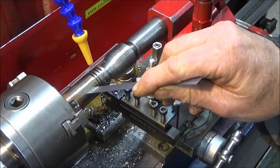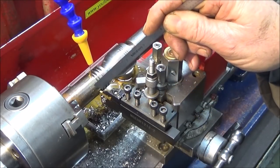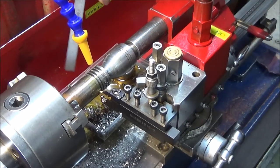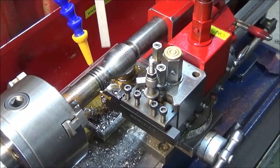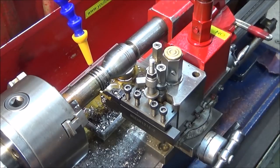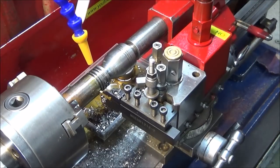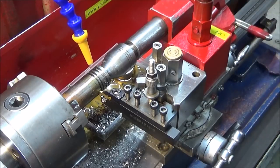I've adjusted the flow and it's ready to go. This is a bit of 316 stainless steel, and this is the groove tool I showed in my last video with a two millimetre carbide insert. I've got a very shallow plastic tray stuck onto the saddle with a rare earth magnet that catches any oil, which I can recycle and use again — this makes the system very economical.